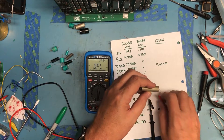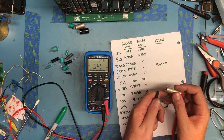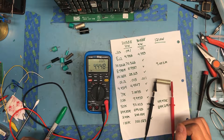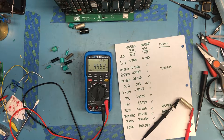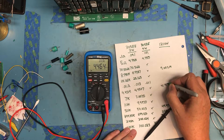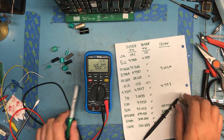4.45 meg. I went with these precision resistors because they're 1% — a couple of them are 0.1%. They're marked, so it gives a good reference. They are really old, so I don't expect them to be spot on. Reading 4.452 meg... we'll call it 4.453. And the other meter also reads 4.453. That's very close.